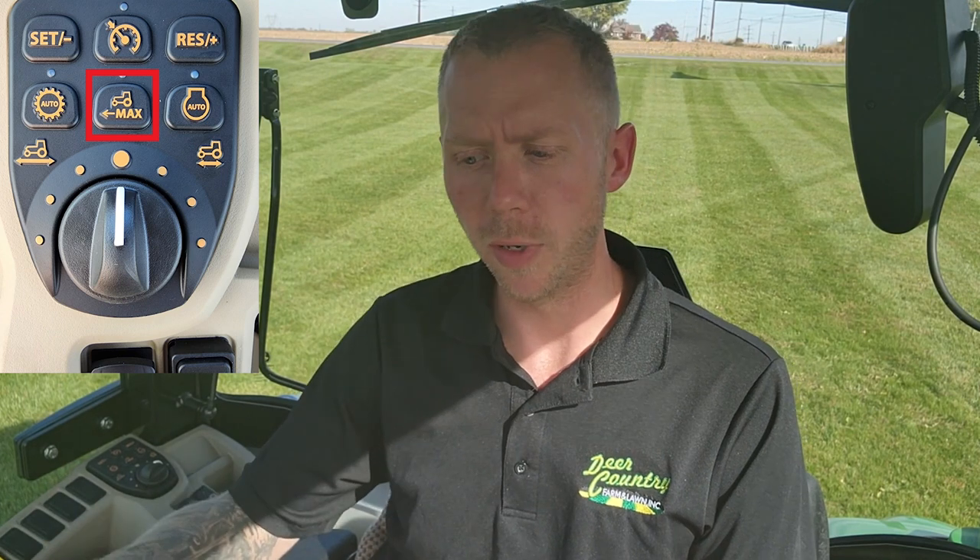Moving back to the center button I skipped over — that's going to be speed match. Speed match, when activated, will limit how fast the transmission can go, no matter how far down you press that hydrostatic pedal. You activate it and use the set button on the cruise control module, and once that speed is set and you let off, the tractor will never go faster than that preset speed. That comes in very handy for different applications like spraying or tilling — you don't want to accidentally start going too fast and stressing out the implement on the tractor.